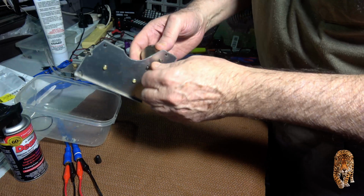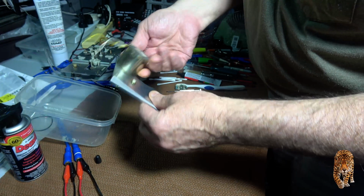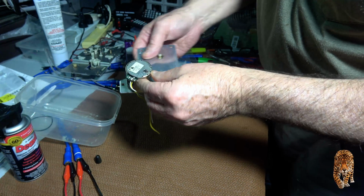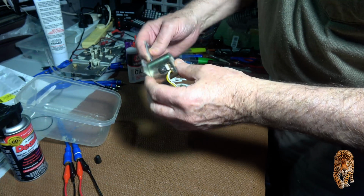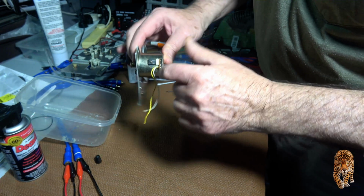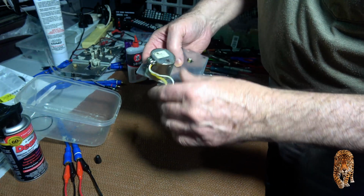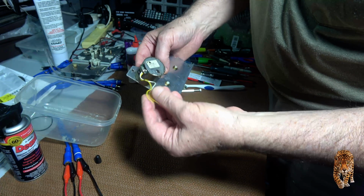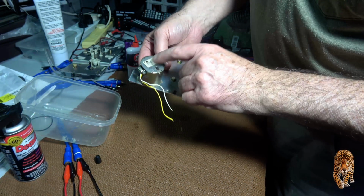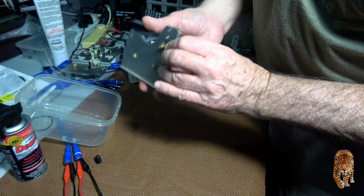Well, I've had a look at the circuit diagram for this Capstan motor. And yeah, it's quite a complicated beast compared to other machines. It has a circuit board feeding it with feedback controls and so on, and that's a Darlington transistor there. And there's the integrated circuit in there. I think these are the plus and minus volts, but that doesn't mean much. It needs the rest of it to be working for it to actually actuate the motor.